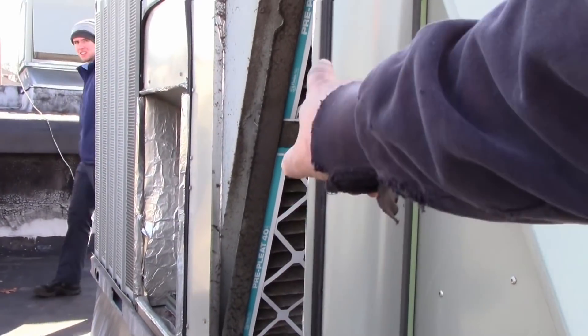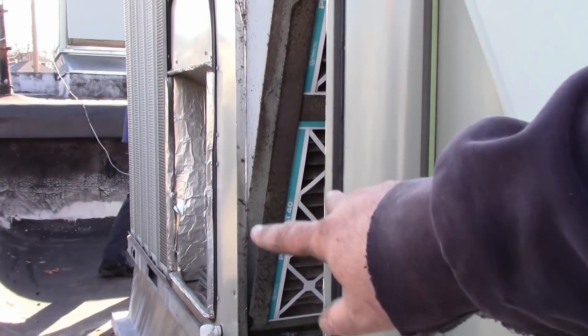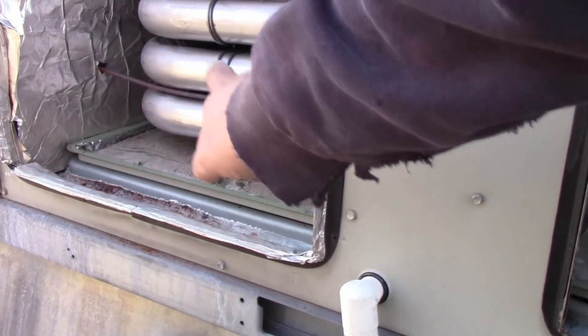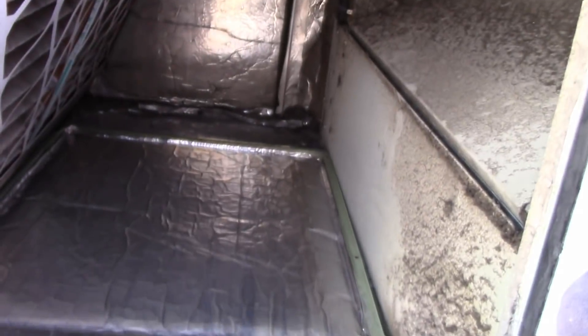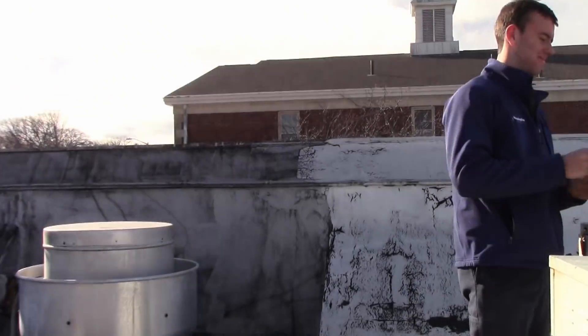The one and only good Trane design is the two panels in the back for your side discharge - your return and your supply. If you swap those, take your return off, it slides perfectly under your supply to block it off. The same thing with the supply to block off the return. That allows no smoke to go down into the building - you don't get to meet the fire department really quick. Although the firehouse is that building right there, so I don't have far to go.